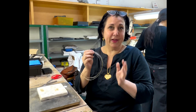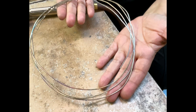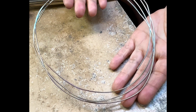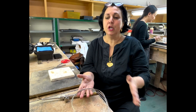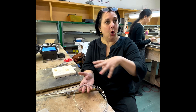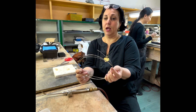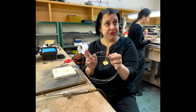I wanted to show something really valuable. Look at this wire — to the casual observer you might say, oh, that looks like sterling, it's all oxidized. Whenever you have mystery metal like silver, you can never look at the surface, because depending on how many times something has been heated and pickled or left to oxidize, it can really alter what you think. A student came over and said look at this, and I'm like, well, it looks like sterling, but we're going to always cut a little piece and melt it and then we'll know.